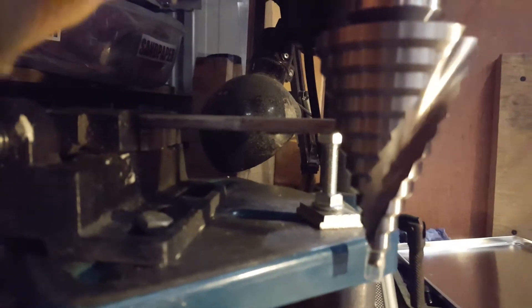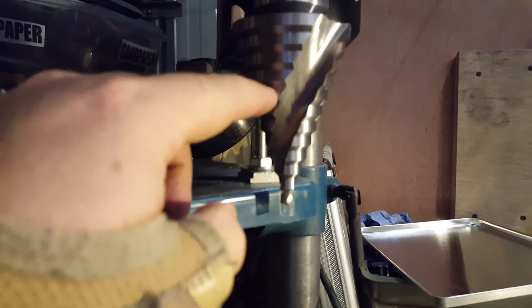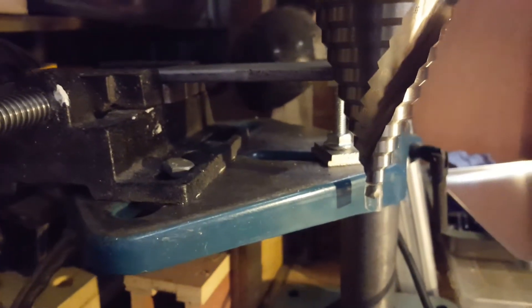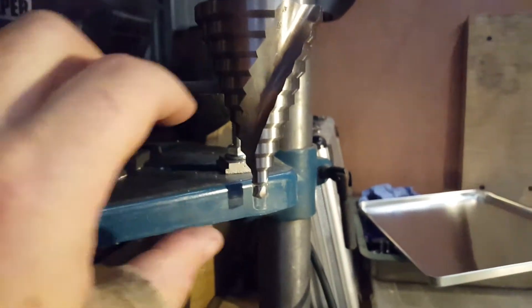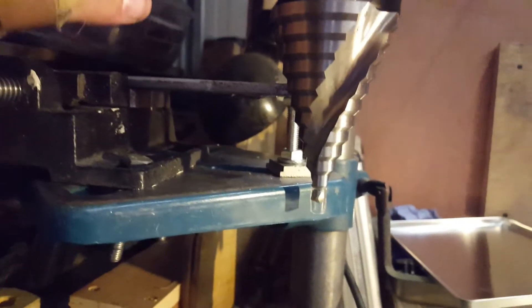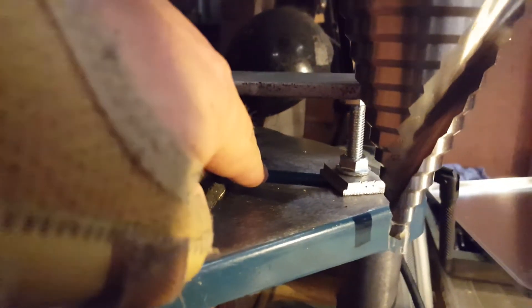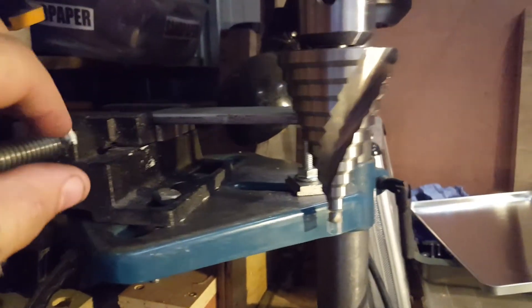And this gets me just — can you see it? I don't think you can really make it out. But trust me, this line here is 40mm. So to get it down here, it's going to have to go beyond the limits of my table. But I'm thinking what I might be able to do is use some of my other step drills first to get it most of the way — get it to like the 30-odd range — and have it properly in the vise for that. But then, just for the last couple of segments, put this thing in and try to arrange it such that this tip will just fall into the slot, and pray to God that if I clamp all this down as hard as I can, this thing won't come spinning out of the vise and knock out the rest of my teeth.